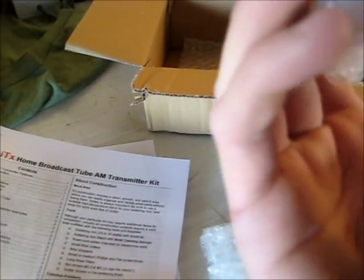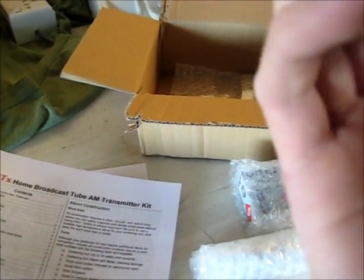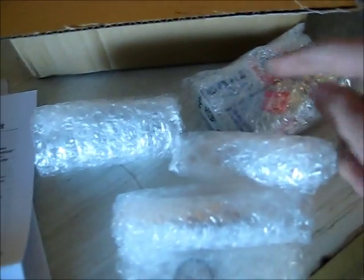I've got to read the instructions on how to build this now. That's the knob for the tuning capacitor, other components — resistors and things. That's the sockets, and that's the big tuning gang. And that's the circuit board that it all bolts onto. I'm going to read these instructions and get building. It requires a 90V battery eliminator, and it has a separate 1.5V filament winding. So these are the 1.5V filament tubes or heaters, or regular 6V heaters. And that's the battery eliminator to power the unit.